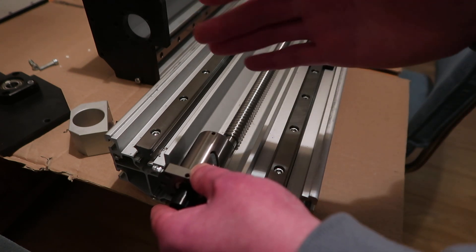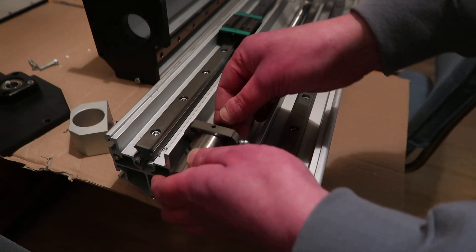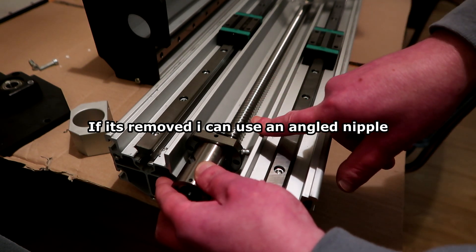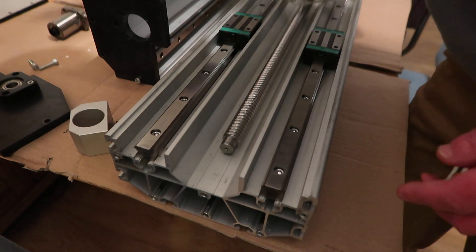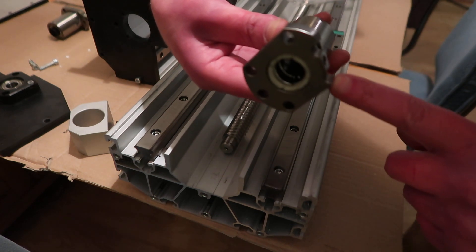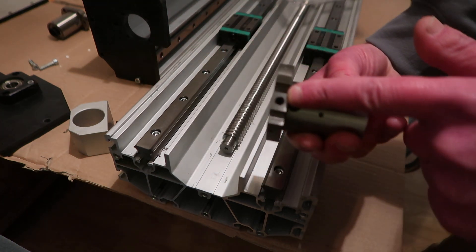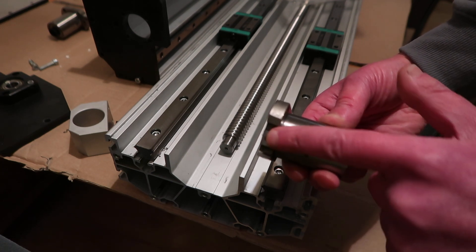I could move the part over and do it in stages on the CNC. I'd have to remove quite a bit of material — I'm not sure what that does to the structural integrity, maybe not that much. Actually that might be the best option, because I already butchered one by cutting away this piece to make room for the grease nipple, then machining a tiny bit so it can line up for greasing and move along again. But that didn't work because the thread isn't as deep as I thought, and I can't thread it anyway since it's hardened.